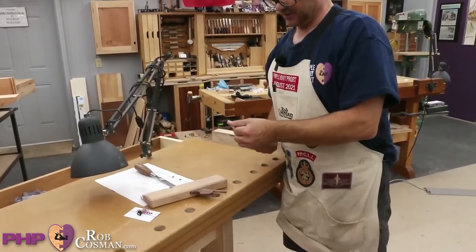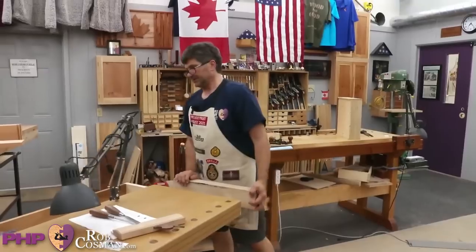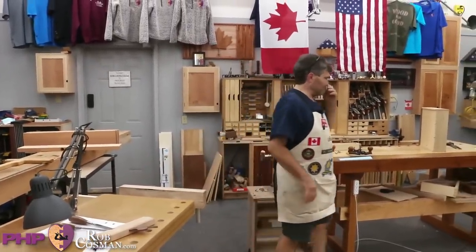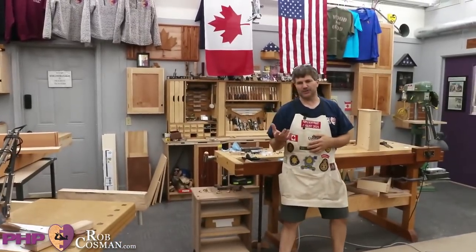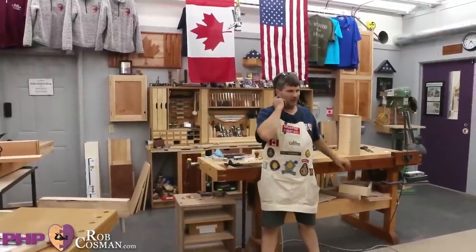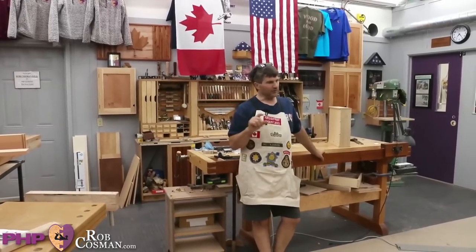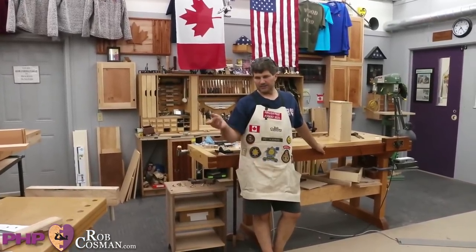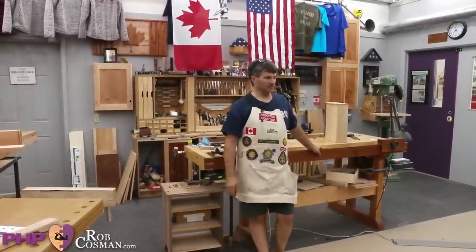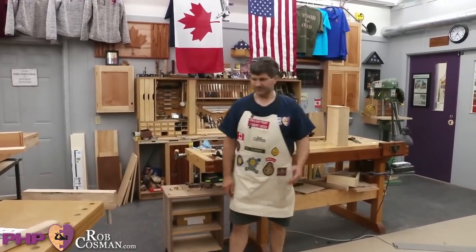Did you explain why you use MDF instead of Baltic birch for the top? It's a question from Charlie McBride. Even Baltic birch plywood, if you take a piece and measure it, is going to be a different thickness all the way along. The MDF is going to be your best bet for uniform thickness throughout. It's relatively inexpensive, and it's heavy and dense, so that's why we started using it.